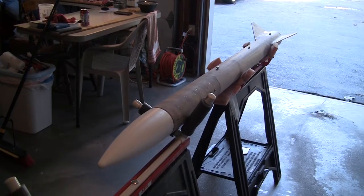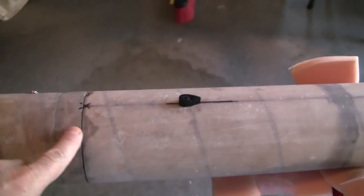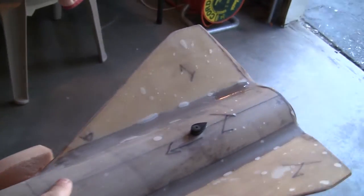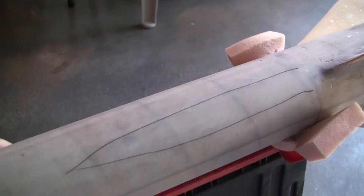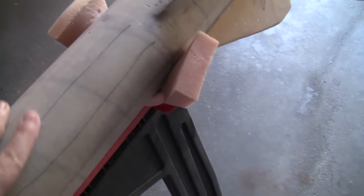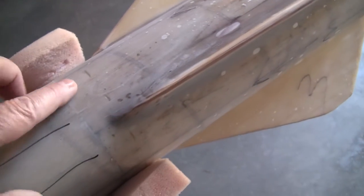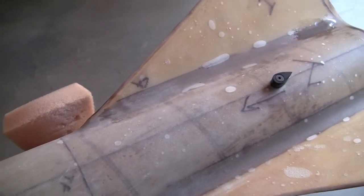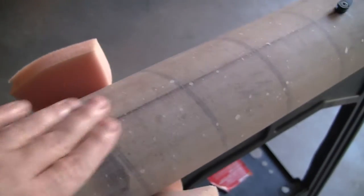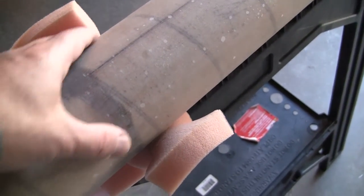Today is Sunday October 11th. We got all the pieces together and finished sanding the three-ounce on the booster section. Found a few high spots where epoxy had settled, marked those out - only detectable by touch. You can see where the two layers of three-ounce from the tip-to-tip to the top section of the booster blend together - you can't even feel the transition. Even where the booster extension was put on, because we did a lot of filler and sanding before the three-ounce, there's no detectable transition at all.